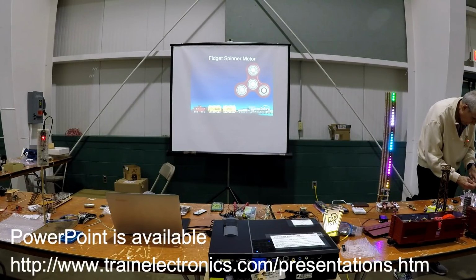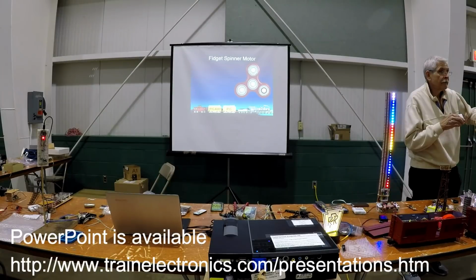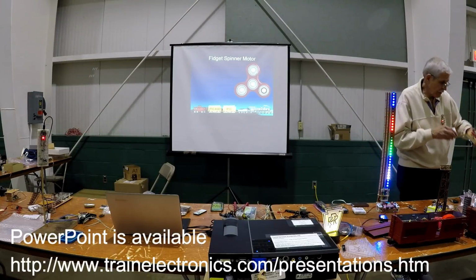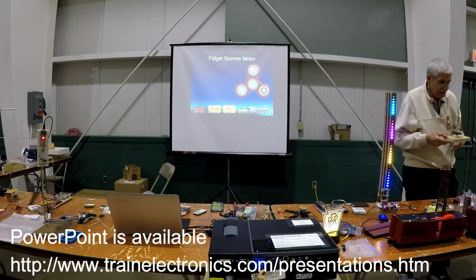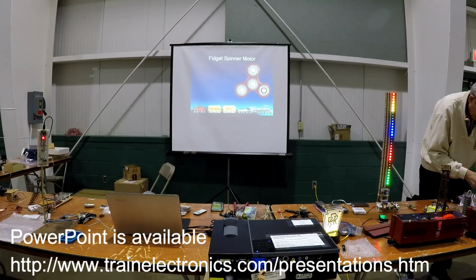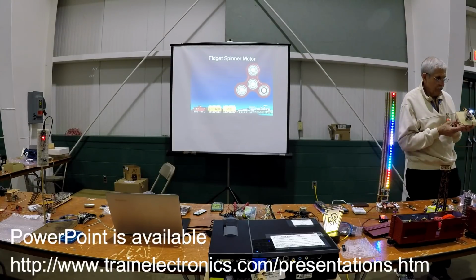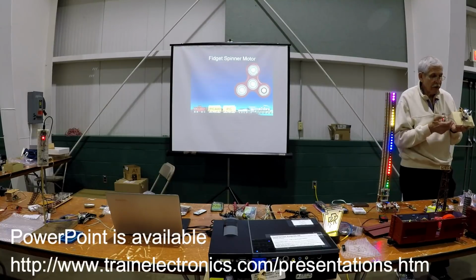That's how a brushless motor works. We have brushless motors. All the drones and things are brushless motors. So I came up with a couple of different ways to build this, including one, let me show you this one. This is great. I replaced the little switch, you heard it getting hit, click, click, a lot of friction, bad things. This one has a digital magnetic sensor called a Hall effect sensor. Wait till I get this one fired up. No noise, just the bearing. That's cooking.